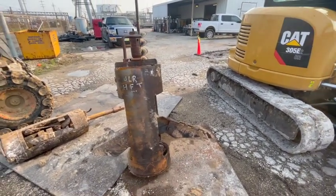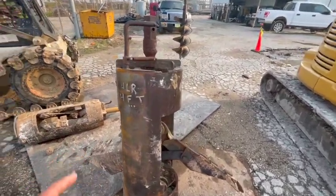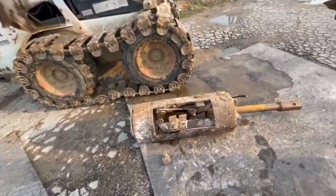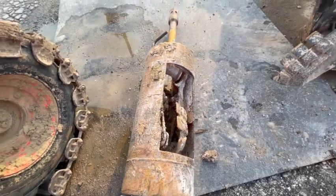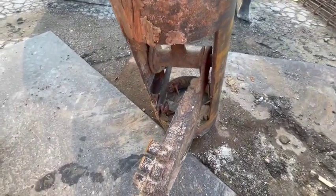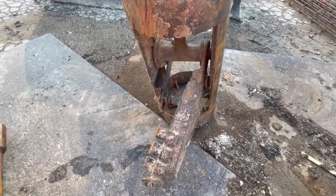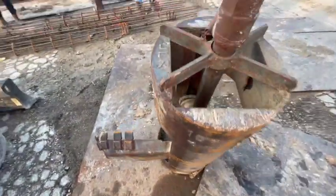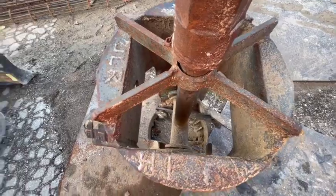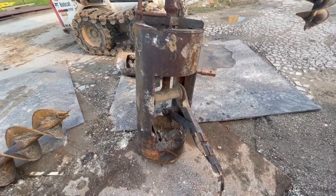See how the arms shoot out? Well, after he drills, he'll drop this down in there, and them arms fold up in there like this one right here. They are folded up in there until they hit the bottom. Once they hit the bottom, they spring out. They go around and they cut the bell on the bottom. Pretty neat. There's everybody to look at it. Some of y'all machinists go, damn, I want to build that. Them things are about $4,500 a piece.